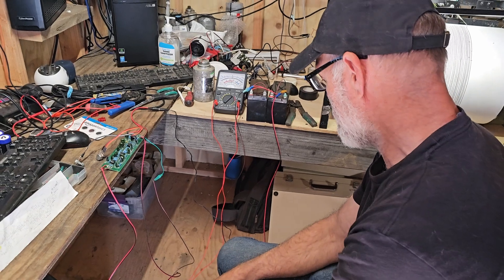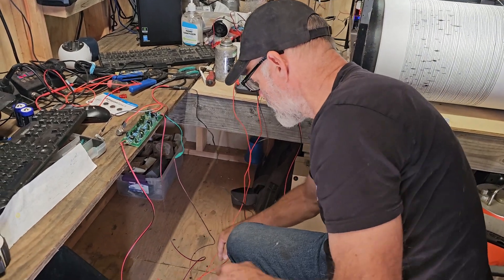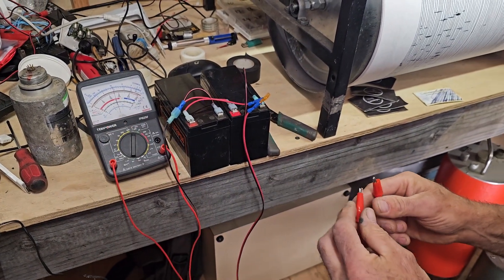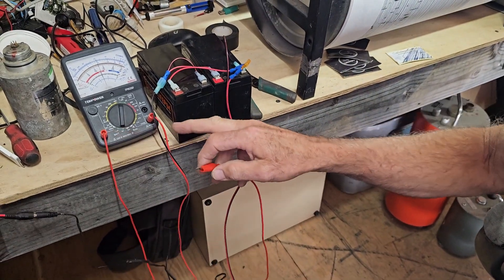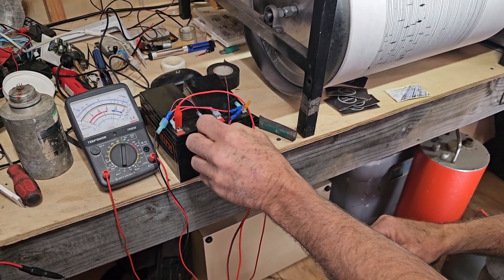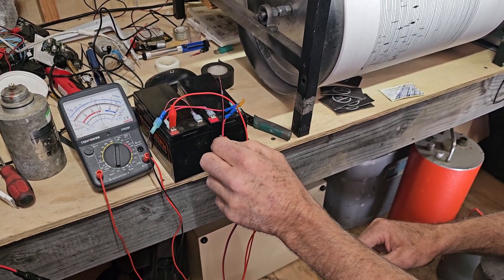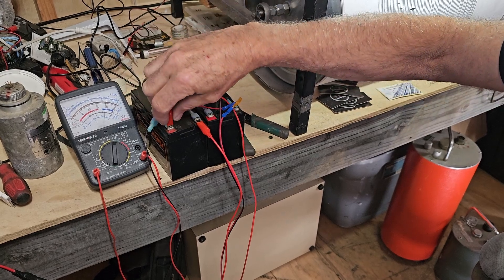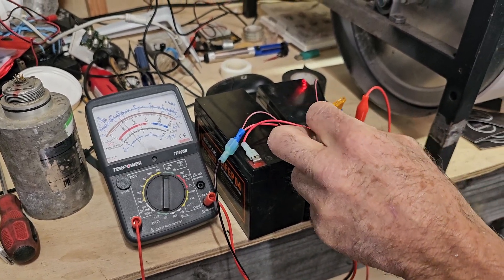Definitely the right way — zero in the middle, positive and negative from there. Let's measure this and see if we have the 12 volts right. It's 25 volts, so this should be okay. This is common and this is my faulted side, so this should be 12 volts coming across here — which it is, 12 positive — and this should be 24. Yes, 24. This is positive 12 volts and this is negative 12 volts. By the way, I did put a fuse in between and the fuse is still good.